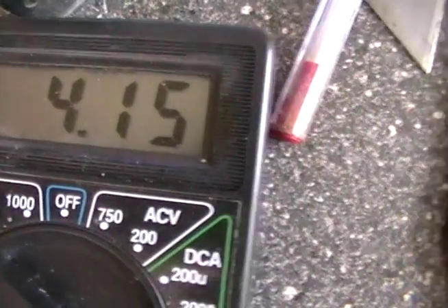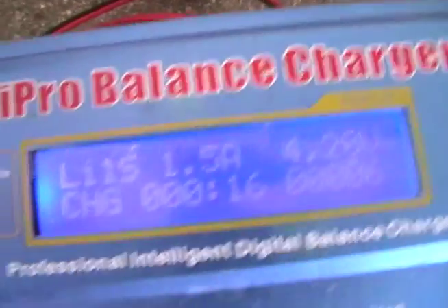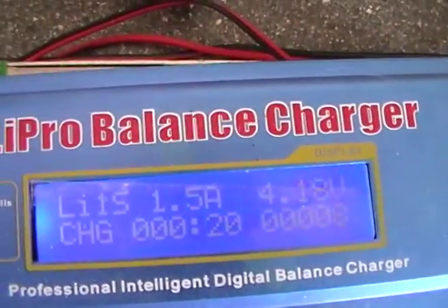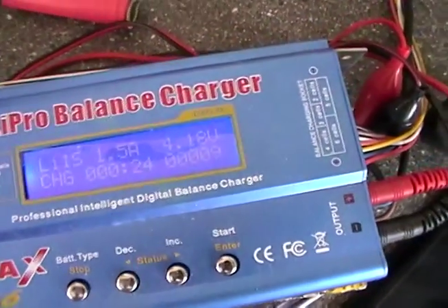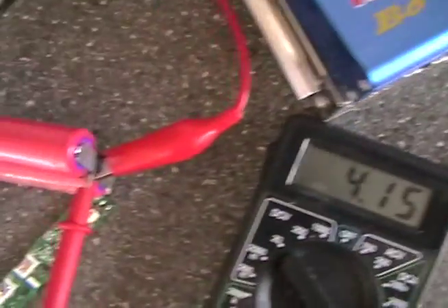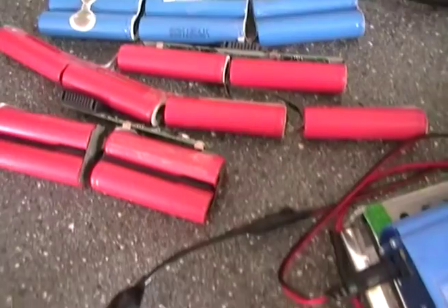So that's going to go down, but if we stick it on charge again at 2.5 amps it goes back up. What it's going to try and do is get it to 4.2V with a good charge, and then the charge will start tapering off — the amperage will go down. In the next video I'm going to charge one of these packs with the BMS cable attached and see if we can get any joy there.